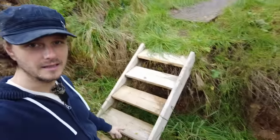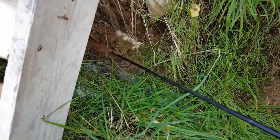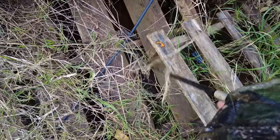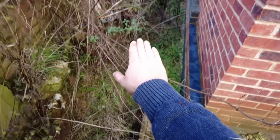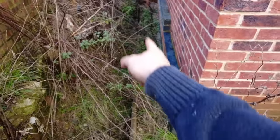I'm going to grab my inspection camera and take a look down the actual French drains. Just before we look down the French drains, I just want to show you — I've got a trench that's still open here, supposed to be a foundation for a retaining wall, and that is full of water. Over here it's even deeper — at least a foot deep. Over this side of the building where the road is, I've still got this open trench here, also supposed to be a mini retaining wall. But this trench has no water in it at all — and that's because the French drain is just here.